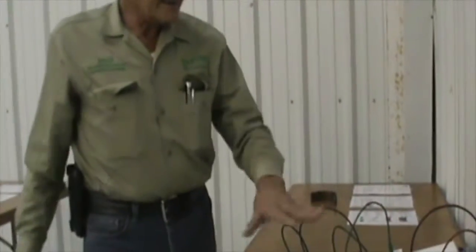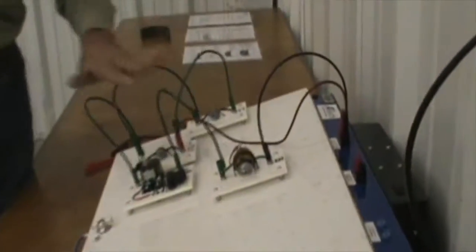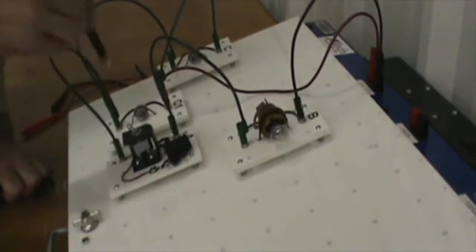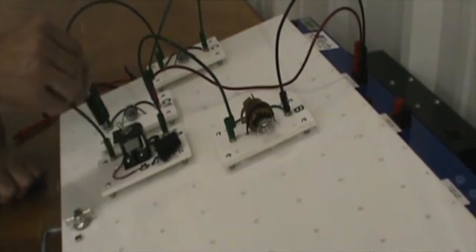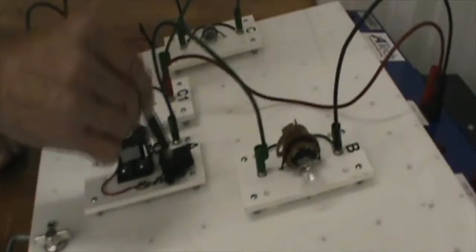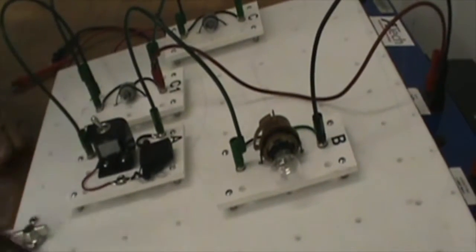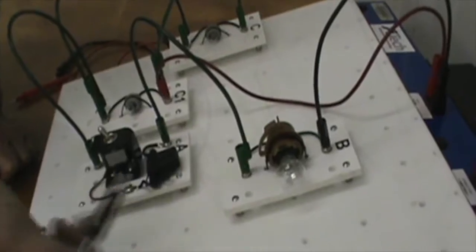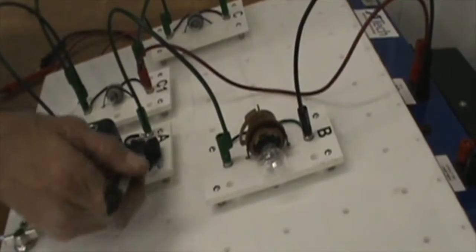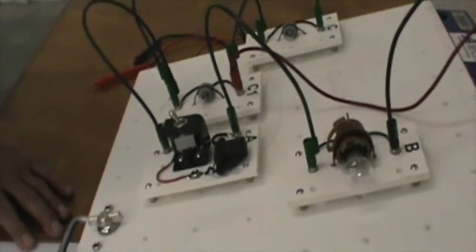The next question: is the entire board fuse protected? This particular circuit is definitely fuse protected, because you see it's coming over here, through a fuse, and back up here. It really matters not if you've got the fuse before or after the device — as long as you have that fuse in there, if you have a short circuit on this end, it's still going to overload your source and blow the fuse. So yes, this is completely fuse protected.